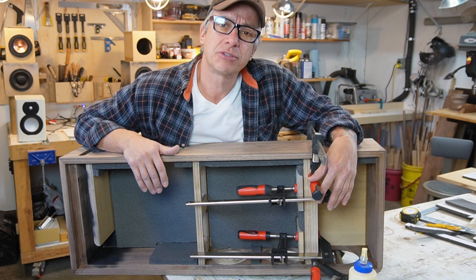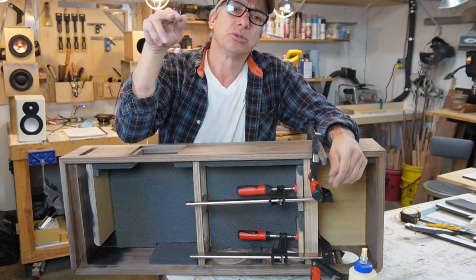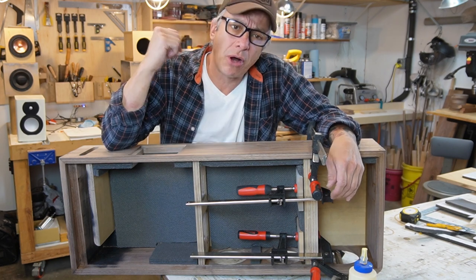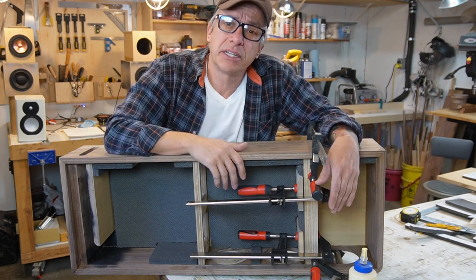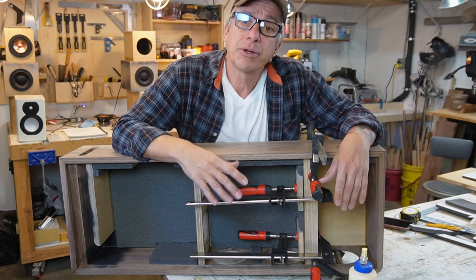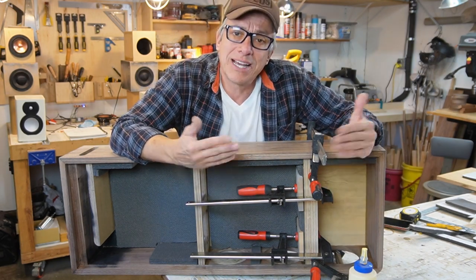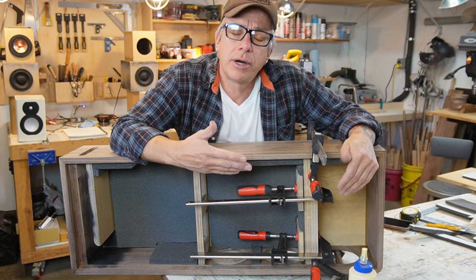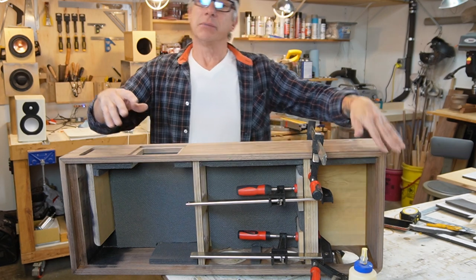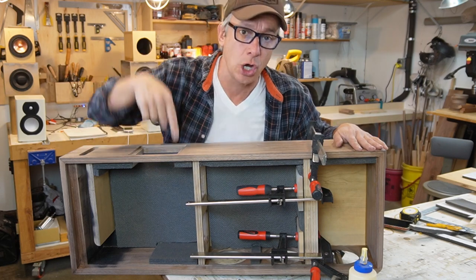According to our frequency response graph, the full range is playing until 100 hertz and then it cuts on that box. Yeah, that box is around 6 liters. We had 7.2 here, so I have a smaller box. We're gonna have a higher F3. If needed, we can always add material and make the box smaller, or we can make a second order crossover and have a steeper slope. So that's the plan. All the information is gonna be on the link down below.